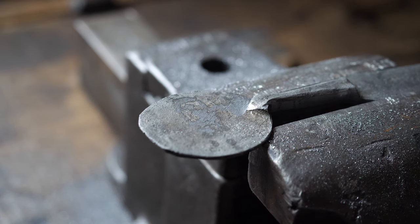It's also cheap and easy to make. It's a pine resin plaster of Paris mixture called Matsuyani. It's a Japanese style of pitch. I did it poorly because it's gray. It should be like a jet black, but I didn't do it right. I think you can find a video of this from Ford Hallam. He has a whole channel devoted to Japanese inlay and engravings and stuff like that, so I'm pretty sure he has a video on his channel on how to make it properly, so you should go check that out. I'll put a link in the video description.